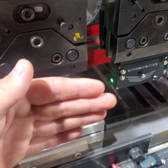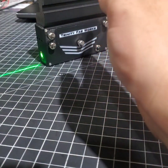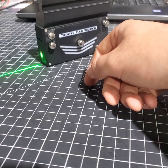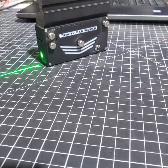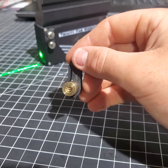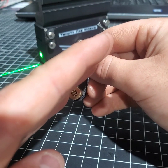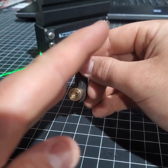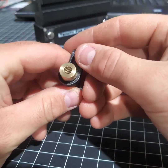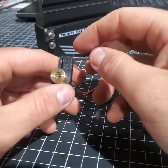There's some adjustment in here - not a lot, but enough to adjust it to make it parallel with your beam so that as you go up and down the beam shouldn't wander forward or backward in the X-axis. The camber adjustment works like this: when your beam goes up and down, if the laser line goes away from you, turn this clockwise; if it goes towards you, turn this counterclockwise. What that does is adjust the laser clockwise and counterclockwise so that the beam is perfectly vertical. If the beam is off at an angle as the tooling approaches, this beam is going to travel back and forth if it's not perfectly clocked vertically and parallel to your beam.